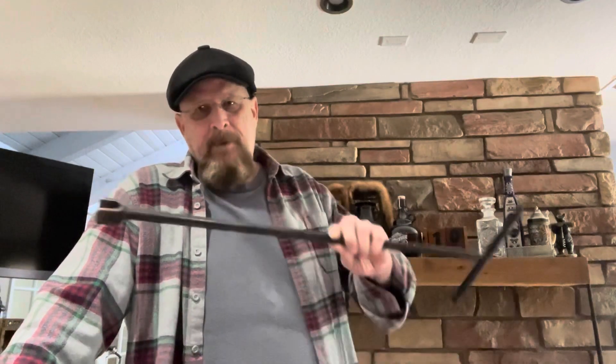Just to close — everybody in the family should know where that meter is and how to shut it off, just in case of an emergency, even the kids. Everybody should have a meter key as well. Not that you can't shut it off with a wrench, but sometimes there's a lot of dirt down there and a lot of people don't like digging around. This is a good thing to have — they're cheap, you can get them at your local home improvement store.